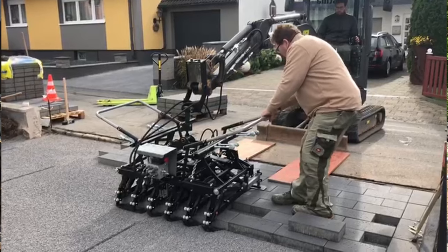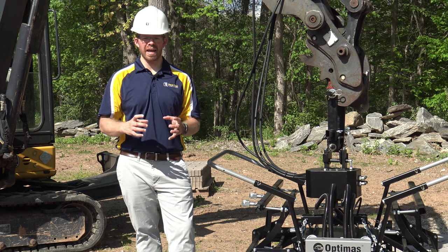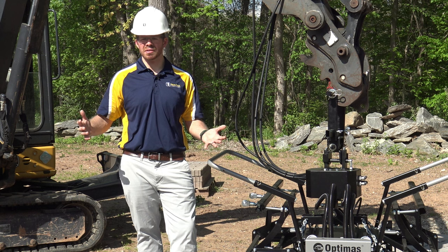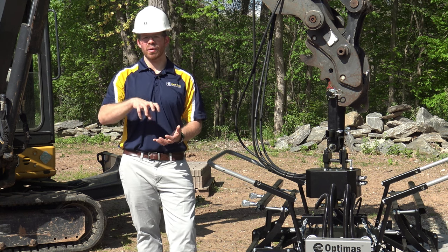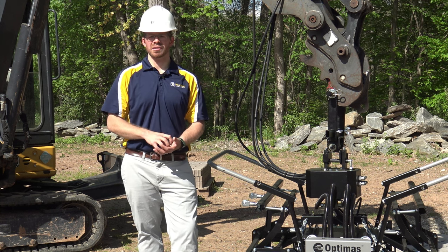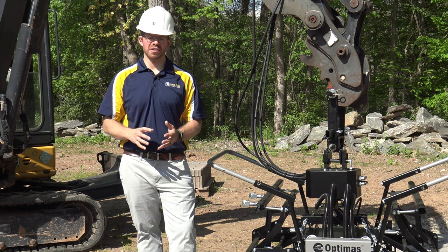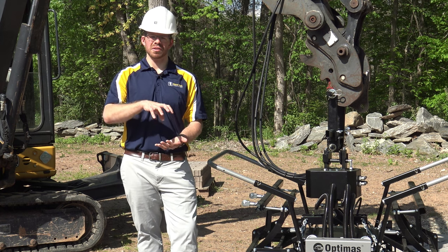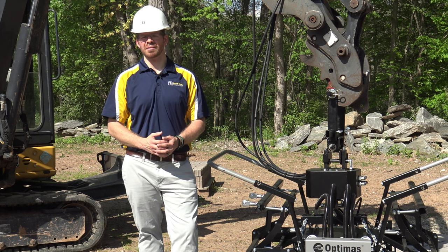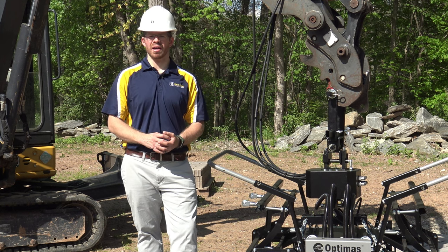This clamp is a phenomenal addition. Instead of picking up individual pieces by hand that can weigh 18 pounds, 25 pounds, upwards of 35 pounds, now you can use a clamp to carry that weight for you. Not only that, you're able to use this clamp to quickly install pavers, far faster than what you could do by hand. Manufacturers are designing more and more patterns to be mechanically installed. Today we have it configured for Unilock Eco Optilock. You have the Hydra series from Tecoblock, and from Belgard, you have the Aqualine series.